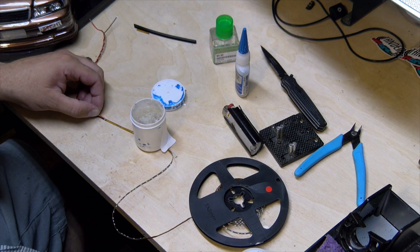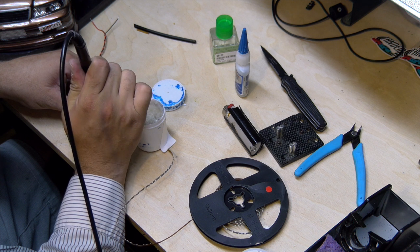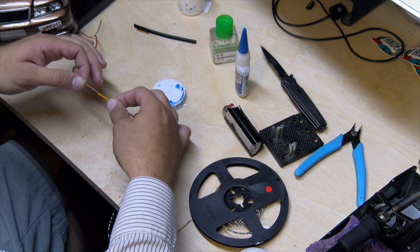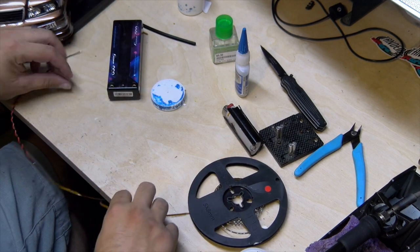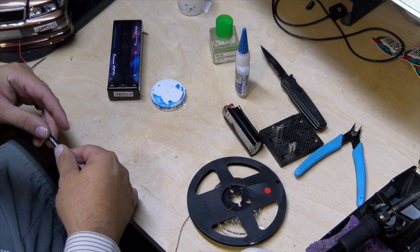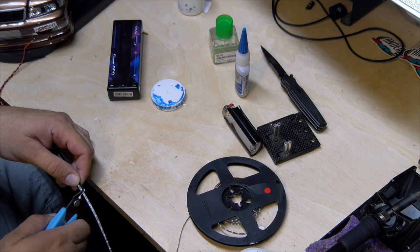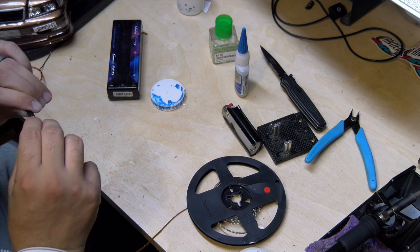Come over here, make sure that the tip of my solder iron has the solder on it, and we'll do a touch. And we're set. Wipe off the extra. Do the pull test — good. We'll do the battery test. We're just gonna snip it just for safety — I trust my solders, but no sense in wasting good lights. We'll snip it one light early; that'll give us some that we can wrap around back into here.